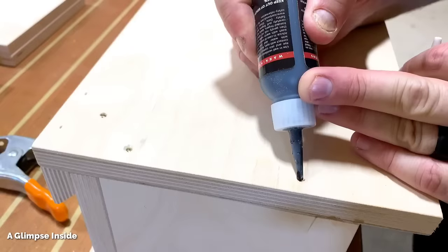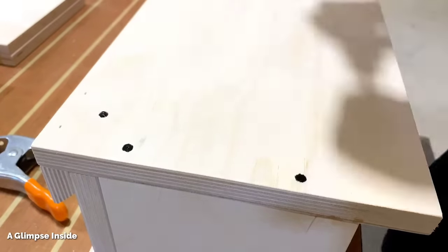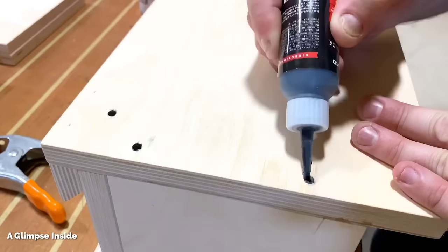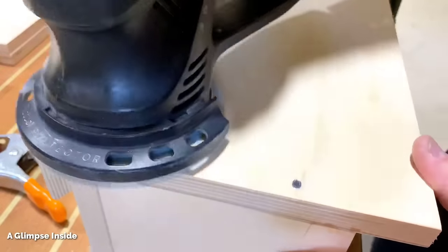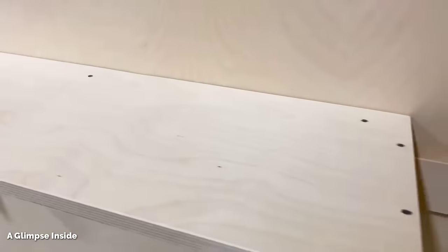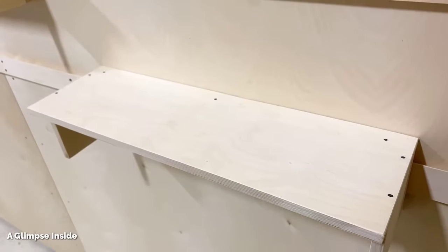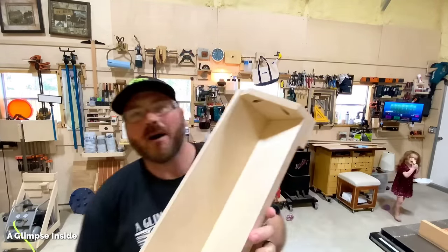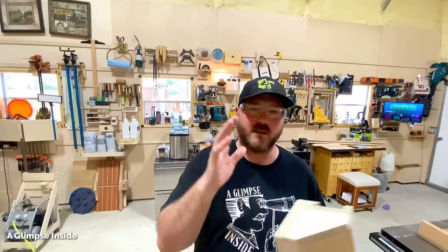It's not rocket science — you can do whatever you want. Those screws leave little bitty holes in the top, and if you want to fill them up, Starbond makes a black CA glue that looks pretty cool. A couple applications are all you need — flood the surface, spray it with activator, sand it flush, and you get a cool little aesthetic. I actually made some of these beforehand in my wife's shop — that's where I got this design from — and I used pocket holes to assemble those. For these I used simple flush trim screw heads. I didn't want to bother with cutting the pocket holes and quite frankly it was easier.